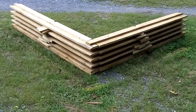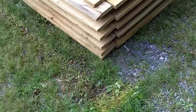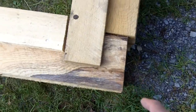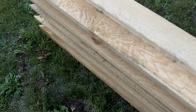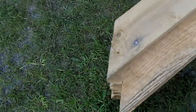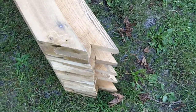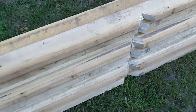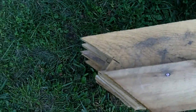So there they are, the principal rafters with the Birdsmouth cut in, and everything looks okay. I already explained that I don't know how I missed that inch right there, because I have one mistake that's blatant. But anyway, there's the Birdsmouth for the rafter stop at the bottom. There are the Birdsmouths for the rafter stop at the knee wall, once again for the other bottom.